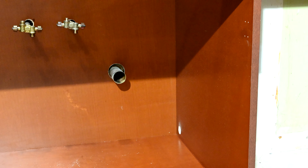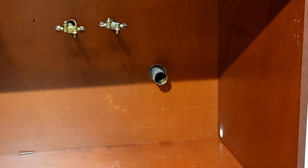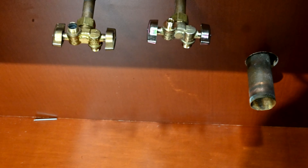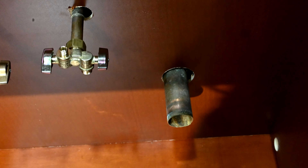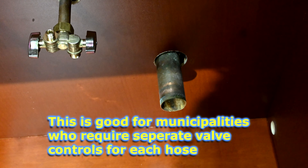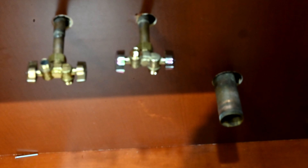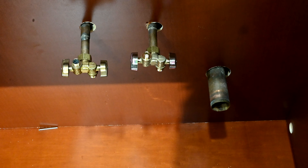We've got the outlet in place and we now have our two dual valves in place. If you've seen our video on the alternatives for saddle valves — I'll put a link down in the description — you'll see how we install these and why we do this type of dual valve. It allows you to add other things. On the left, the hot water dual valve has two connections for hoses — one goes to the sink and the other goes to the dishwashing machine. Over here on the right on the cold water, there are two connections: one goes to the sink faucet and the other is a quarter-inch one that goes to the ice maker line. This way you don't have to add a saddle valve — and you know how I feel about saddle valves. This is our preferred method of doing valves under the kitchen sink.